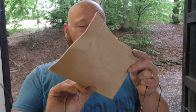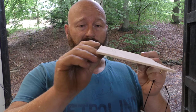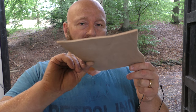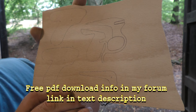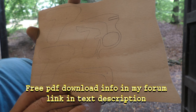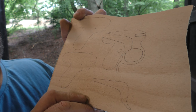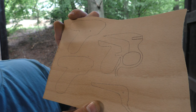It is really easy to make this and of course you can also change it — you can customize it any way you want. So let's begin with the project. We begin by finding a piece of plywood or other thin wood. Make sure it is not too warped. This one is about 4mm in thickness, but if you have 3 or 5mm it doesn't matter, just as long as it is somehow thin. Next, download the PDF file and print it out, making sure the dimensions are right. I will put in a little rectangle for your reference. Then you trace the outlines to your piece of wood. You could alternatively use some glue and put on the entire paper to save time, but you have to fumble off the paper later on, which is also work.